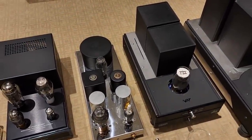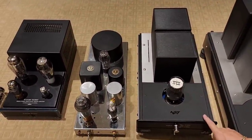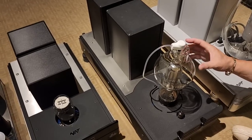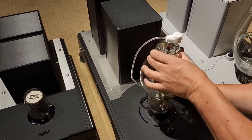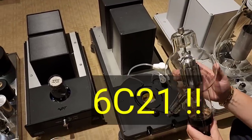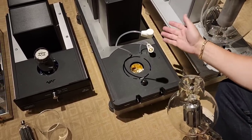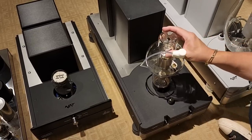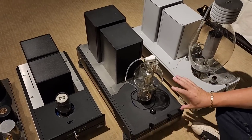Now we take it up one step. Those first two were 8 watts each — this is 20 watts of Class A single-ended triode. This next amp is 120 watts of Class A single-ended triode, using a much larger tube. These tubes are used for radio transmission — a big 6C33 — and with these massive transformers, it puts out 120 watts. A 6H30 or 6N1P drives this tube as the kickstarter for the big tube. This gives us 120 watts of pure Class A single-ended triode.